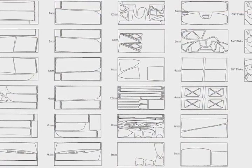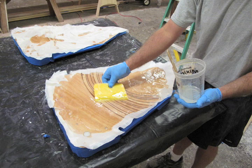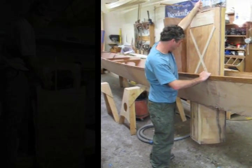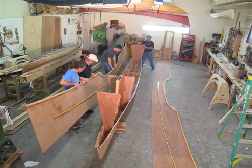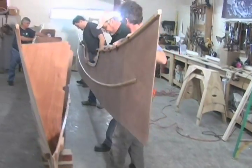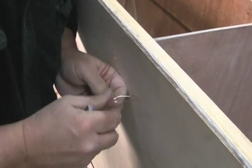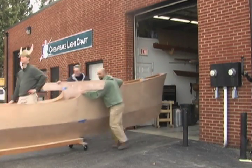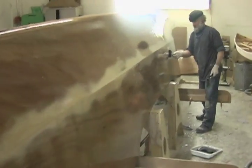Every part of the boat was cut out on Chesapeake Lightcraft's CNC machine. The entire hull was made up in sub-assemblies consisting of flat panels, which were even fiberglass while still flat to save time. Components like the rudders — two of them, one for each end of the boat depending on which tack you're on — were built first and tested in their trunks before the hull was assembled. The main hull is very deep and narrow, so we had to install the trunks before the sides of the hull were added. Once everything was ready, I gathered up some friends and colleagues, and the final hull assembly was over with in just a few minutes. The parts snapped together like Legos and were held in place with the same copper wire stitches that we use to put together 14-foot kayaks. It was cool to see the hull all in one piece after a lot of months of staring at the drawings. From there, it just took epoxy and fiberglass — lots of it — to create a hull that weighed only a few hundred pounds.